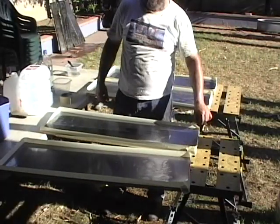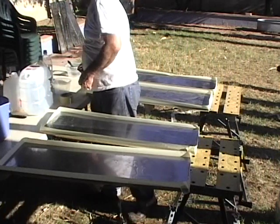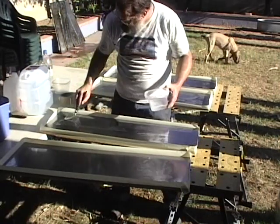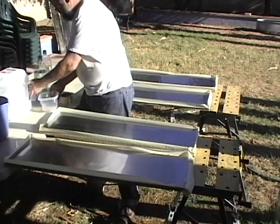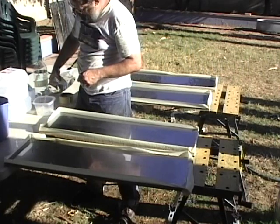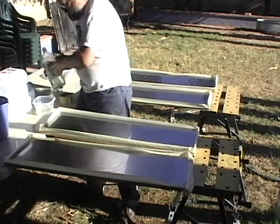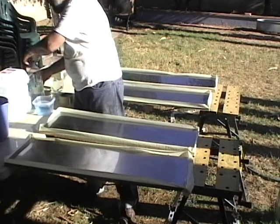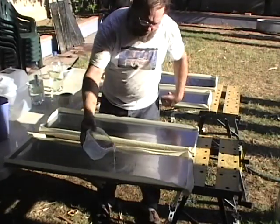Okay, and now the secret weapon, which I'm guessing Archimedes may have found as well — and that is to silver the otherwise plain steel. The process for that alchemy is to start off with a sensitizing solution to go on top of the pre-coat that I put on yesterday and allowed to cure overnight. Ready for the magic to begin. Let's take the quantities: A, B, C. Let's turn the solution blue and begin pouring over the surfaces you want to turn silver.